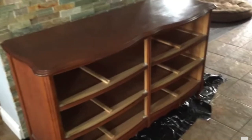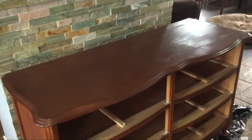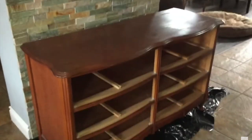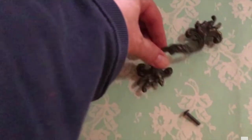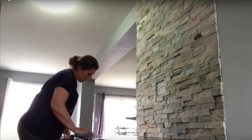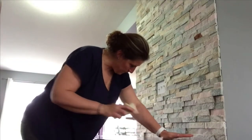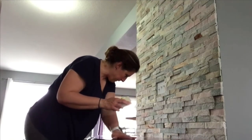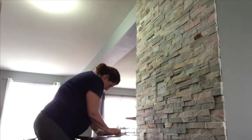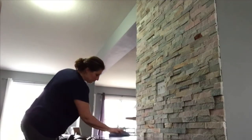Number four on my list is a little cabinet I have sitting in my kitchenette behind my loveseat in the family room. I really wanted a piece of furniture behind my couch so I picked this up for $40 at a thrift store. I ended up staining the top with Java gel stain, but before that I kept all the hardware and gave it a really good cleaning — first a damp rag, then a little sander to remove any imperfections, whether from damage or stuck-on debris.